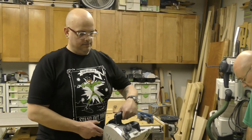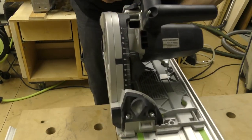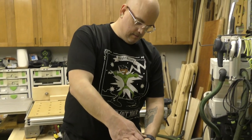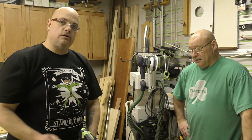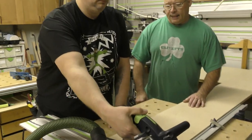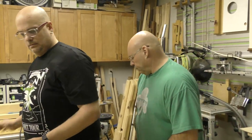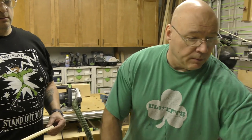You got the depth set, it's perfect. Using the same depth. Get behind the saw. Remember, plug that cord in. Full quarter turn. Okay. Perfect. Okay, so I'm gonna take that out of there. Okay, good. Perfect. Now, before we go and reset it, I wanna make sure that this is 90 degrees here.